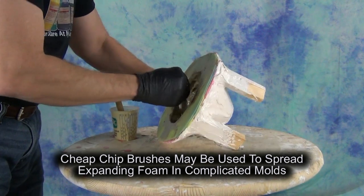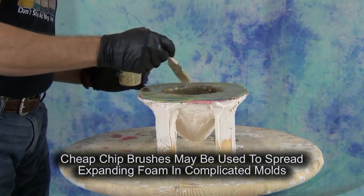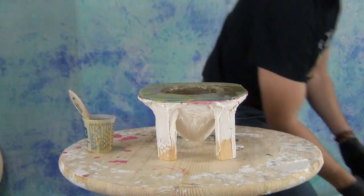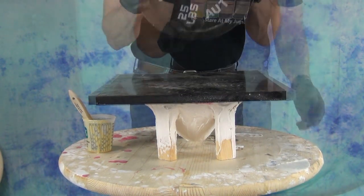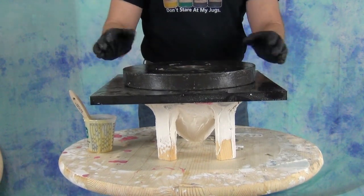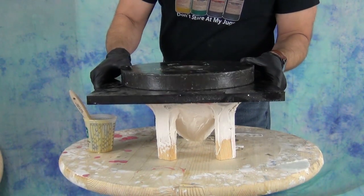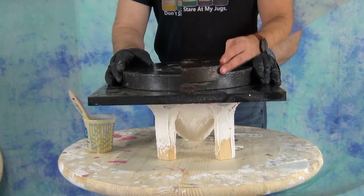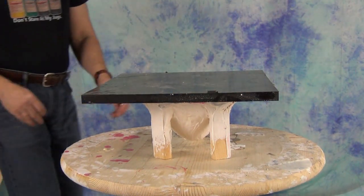What I'm doing here is just using a cheap throwaway brush to spread that foam around as it expands. With rigid casting foam, it expands a little bit slower than some other foam systems, so you do have a little time to get it spread across a more complicated part with a lot of surface detail. Now I'm going to put that plastic board on the back and a weight on top of it. I put a minimal amount of foam here so I'm not too concerned about overflow, but if it bumps up against the top I want it to form a flat back rather than a mushroom shape I have to saw off later.